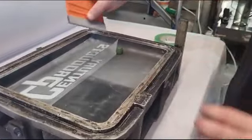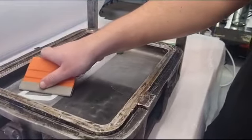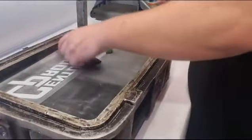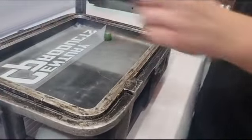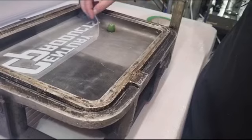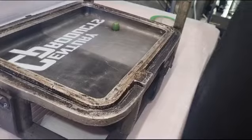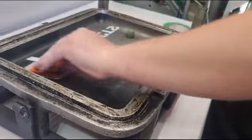From the center, come out to the sides, pressing out any possible air bubbles — any air that's trapped in between the surface of the mold and the graphic. Now, an important step is to make sure you remove this transfer tape. This tape is what holds the graphic together and helps with aligning the graphic on your mold. Remove that, and just go over again with the squeegee.